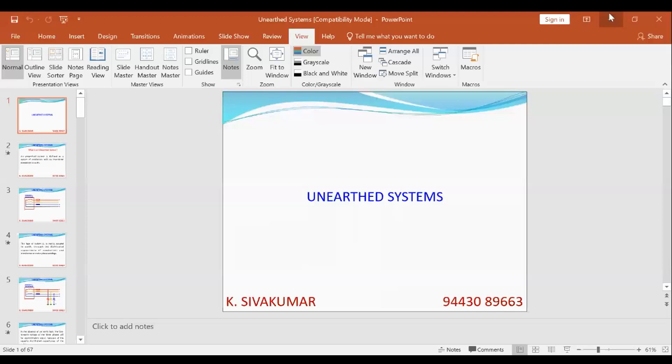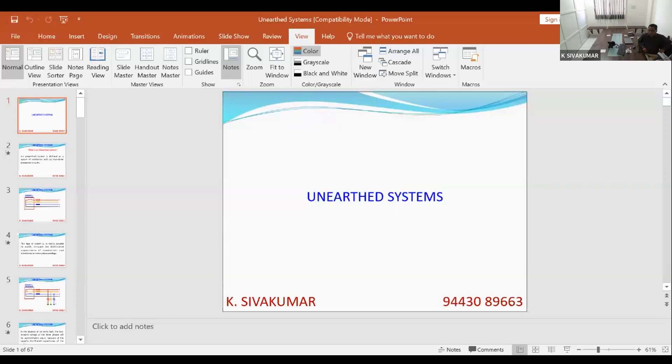Question from Santosh: how to select correct rating of lightning arrester for an unearthed system? For an unearthed system, you go to the rated voltage. The IEC standard gives a graph for selection: the rated voltage depends upon the R0/X0 ratio and X1/X0 ratio. For an unearthed system, the calculation is: highest system voltage multiplied by the ground fault factor of 1.732. So for an 11 kV system, 12 kV × 1.732 ≈ 20 kV — you must put a 20 kV arrester for an 11 kV system.